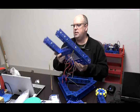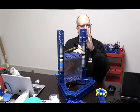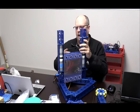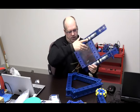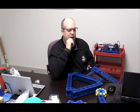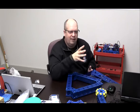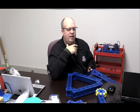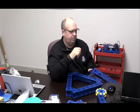As we stated with these ones, you'll notice that we have two set screws in, so that we can make sure that we're on that D shaft and we're not going to get any slip at all. You might want to discuss with your students why we would use a round shaft, why we would use a D shaft. I do have some motors here that we use a hex shaft on. But as I tell people, there's certain things that are going to fail that are less expensive, and I'd rather have them fail than the more expensive part. Sometimes you can over-torque the motor and fail the motor, where I would rather have a hub come off a shaft because I can always simply retighten that.